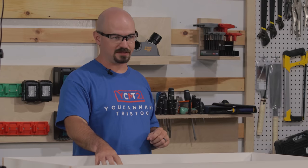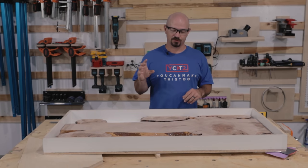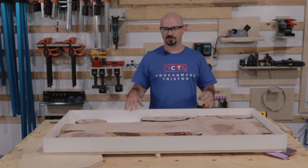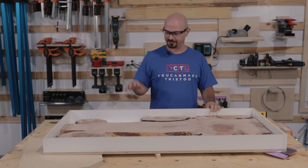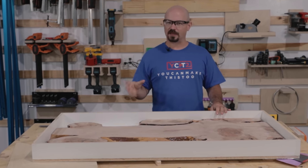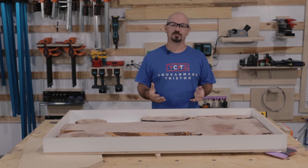So our slab is about 1 1/4 inch thick. In my experience in my climate, I can do thick set at about 3/4 inch. From what I've heard, in this climate, about 1/2 inch is the max. We're going to cheat, try to go about 5/8. So two 5/8 inch lifts should get us there. And then there's this balancing act with any deep pour epoxy, where the thicker you go, the faster it's going to set and cure.